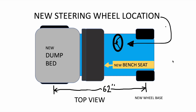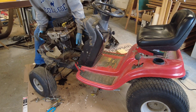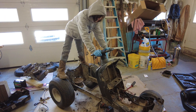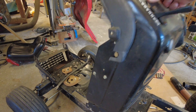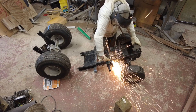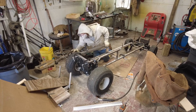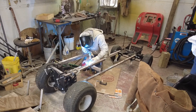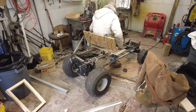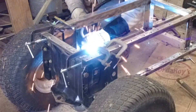This turned out to be one of the more challenging problems of the build. The next morning we got to work stripping away everything that we weren't going to use. Once it was totally stripped down, I cut the middle section of the frame out. Then I used salvaged angle iron from old bed frames to make the wheelbase longer. Bed frames are good steel, but it's hard steel so I have to use a friction blade to cut it — it will rip the teeth right off a band saw. After determining the length by imagining where the accelerator pedal would be, I finished the welds.